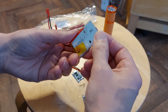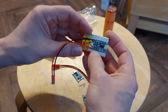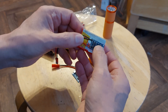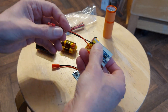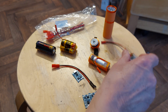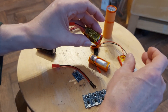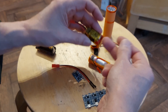That's another one — that's a lithium-ion battery. That's just double-sided tape holding it in place, so the battery is soldered directly to this board, and then again that would plug into whatever you want to power from that battery. So neither of those need a separate LiPo charger — just an ordinary USB supply.